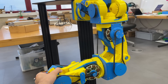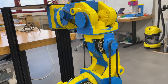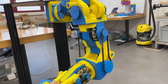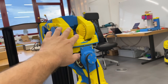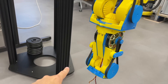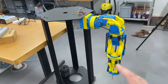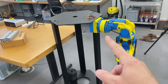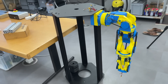So this is the wrist, this is the elbow, and this is the shoulder. Ideally I need to 3D print the covers for these bevel gears, and also I need to put the grease. I'm not really happy with the fixation of this robot arm because this frame is not super stable — I need either to put a really heavy weight over there, or fix it somewhere, because right now I have the 8 kilo weight on quite a small lever.